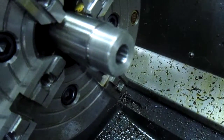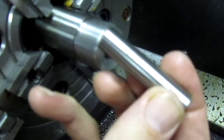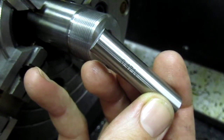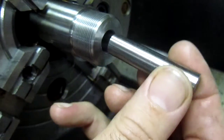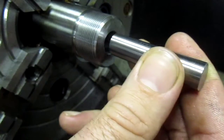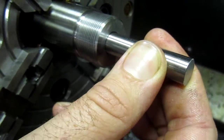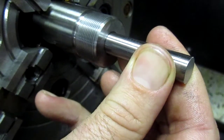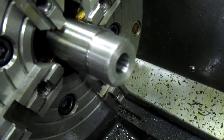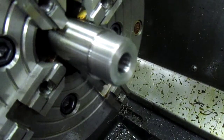What I've got next is a .471 — because we are checking a .308 and it should have a diameter of .472 — and this actually starts to go in just a little bit and it's actually pretty tight. So that shows us that the chamber was cut pretty much exactly to the diameter of the reamer, and the way that we do that is with a proper setup.